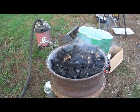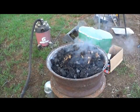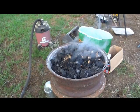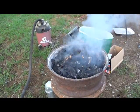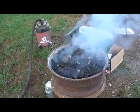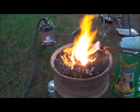I'm starting another load of charcoal on the forge to be heating the second knife. I have the damper door all the way open now, so some of the force of the air is being dissipated. Let me close the door and let you see what happens. You see that instantly we're getting much more airflow through the charcoal, so now it's going to heat up much more rapidly — no doubt about it. I have two small knives to harden and I think I can get them started now.